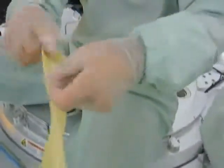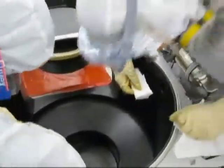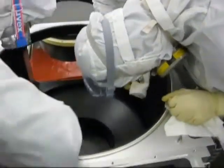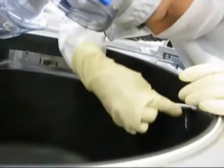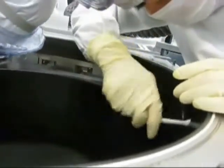It is good practice to replace gloves with a fresh set prior to performing the final wipe portion of the PM. For the final wipe portion, saturate a mirror wipe with IPA and proceed to wipe down all areas of the etched chamber. In addition, saturate a mirror swab with IPA and wipe out all the hard to reach areas throughout the etched chamber.